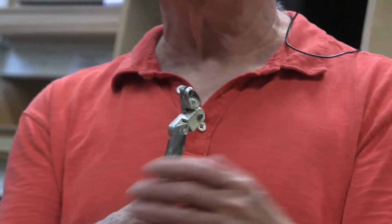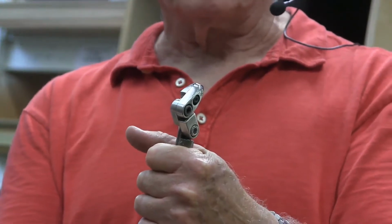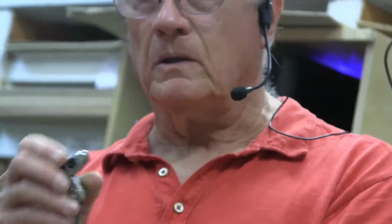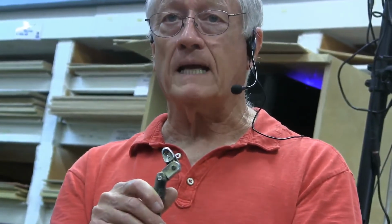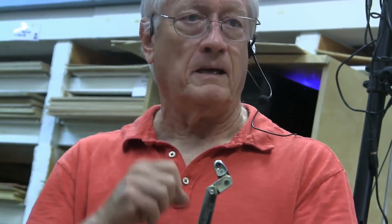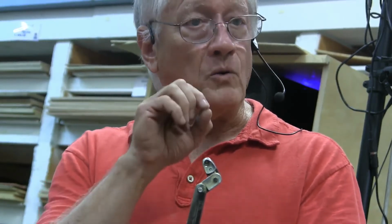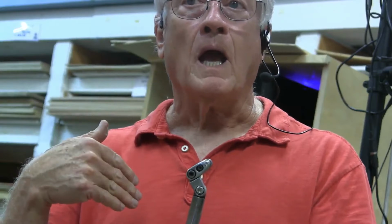People really had a problem when they first bought this, and there were a lot of complaints, and a lot of them tried to send their tools back. With a shielded cutter tool like this, there's a counterintuitive aspect of it. If you say, hey, I'm going to get a lot done, and I'm going to open that guy up, I'm going to take big, thick shavings, all you got to do is clog it. It clogs with thick shavings. When you go thin, it's just much better behaved. And also, are we on low range now? Good.